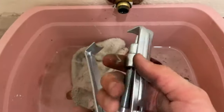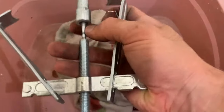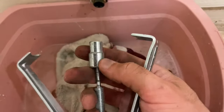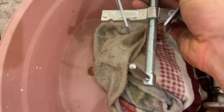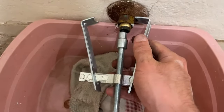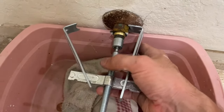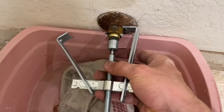So your sleeve puller — or whatever you want to call this thing — it's going to look like this. There's this part right here that comes off, you can flip it around. Because I'm working with half-inch pipe I'm going to be keeping it on this side, and then we're going to push this into there. I'm going to start twisting this and put the little arms behind the fitting — I'll show you when I put the phone down so you can see what it looks like. Basically it's going to pull this thing off.